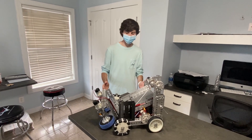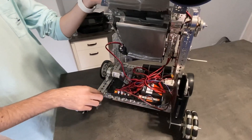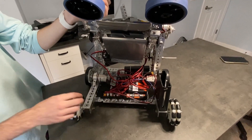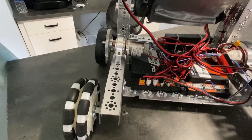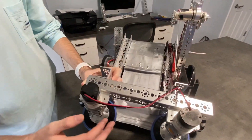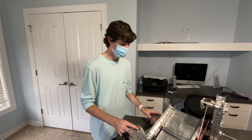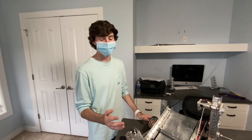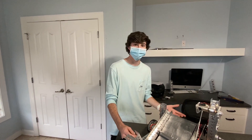To summarize the chassis for our weekend build, we used a basic U-frame chassis. We have all of our wiring underneath our conveyor belt. We have Omni wheels up front and the two drive wheels at the back with a gear system right above our two expansion hubs. We did this to free up space for the conveyor belt in the front. We used Omni instead of Mecanum — we used an Omni drivetrain on our actual robot last year and it worked out well, so we tried it again and it also gave us more space.